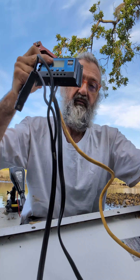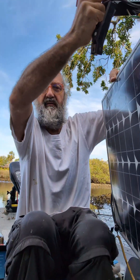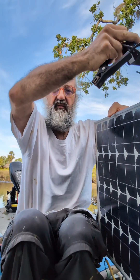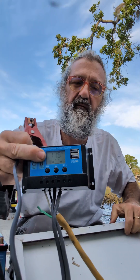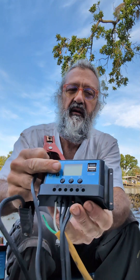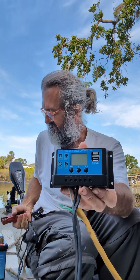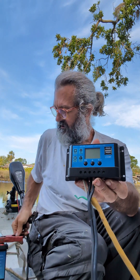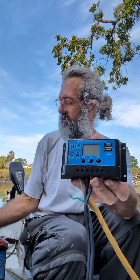The battery has to be connected first, which is a problem because we already have our solar panel connected on the wrong side. I'm going to cover it — otherwise it shows some voltage, which is not good. You want to kill the voltage first, because the controller uses it to determine whether you're on 24 volts or 12 volts.